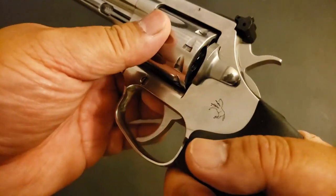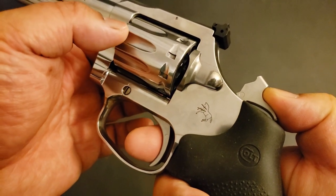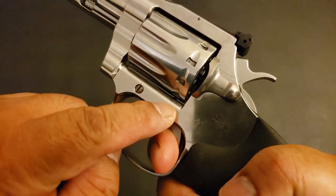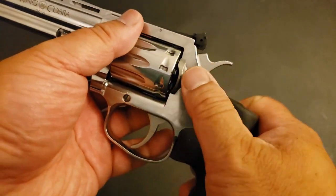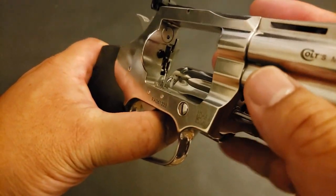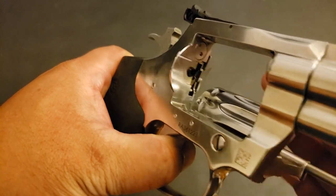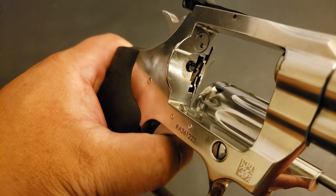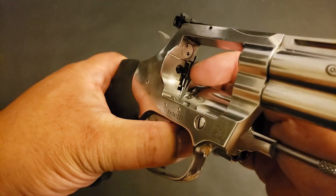That little hand is what pushes on the little gear on the cylinder. That hand is what makes the cylinder rotate, and it's also what locks up the cylinder. On the Colts, that little hand — when it's fully up and pushing — it's pushing the cylinder against that stop bolt, really locking up that cylinder nice and tight. Obviously, when the hand has finished its job, it has to go back into its little recess. So when I release the trigger to reset, the hand goes back in. That's the part that was being gritty.